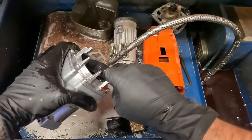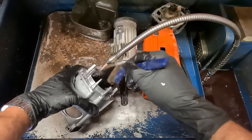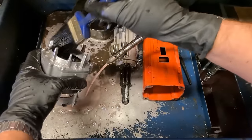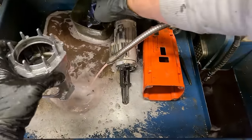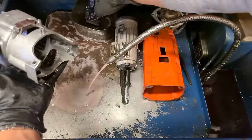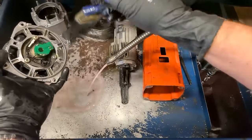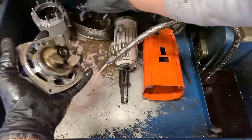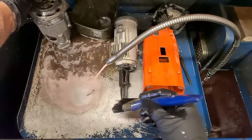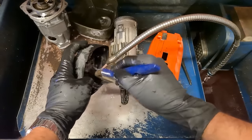Look how thick that is there. Kerosene's not even touching it. Put something a little stronger onto it. Soften up. Do the same with this. And this is a lot stronger. Helps take off that old tar buildup. You really want to be using a mask or stuff like that. Fairly carcinogenic.